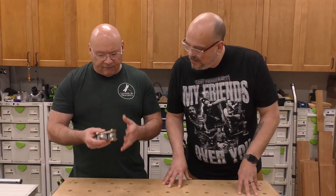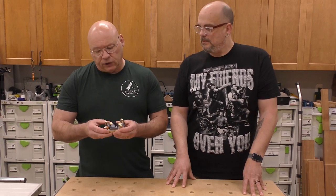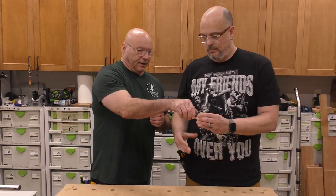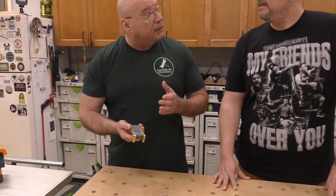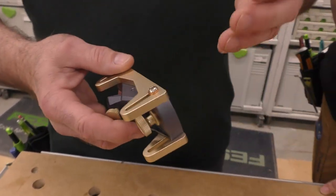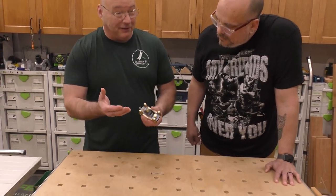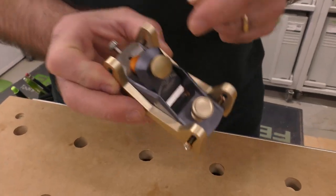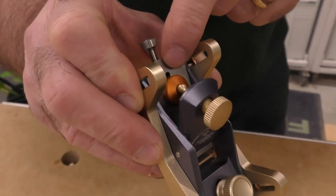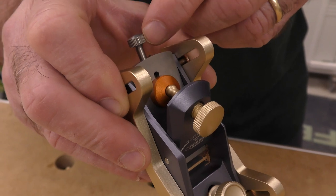Check this out — I've had this out of the box already. I want your first impression of this mini block plane, so I'm going to put it in your hand. That's really, really light. There's a reason. I've had some old Stanleys in the past that were made out of aluminum — they're very rare. This whole sole is made out of aluminum. One of the great things about that is it's light in weight, fits perfect in your pouch, and it won't rust. Now this part right here is known as a cap iron, and this is your locking knob or tensioner — that's what holds the blade down. That's a Norris style adjuster.